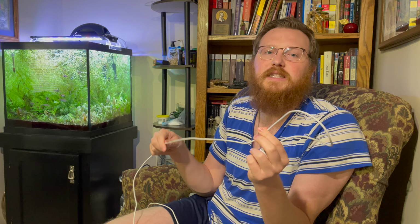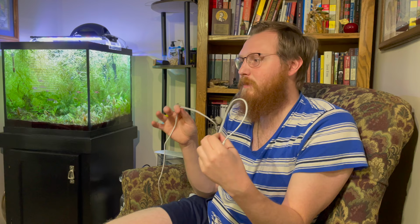I try to, but when you're moving things around and adjusting things, sometimes you don't realize that your cords are all just tangled up at the back of your cabinet and that there's no lines going down past where your outlets go in and going back up. And that's what happened to me when my hang-on back filter, which hang-on back filters are eventually going to fail at some point or the other, especially if you have a pump that's on the outside of your hang-on back filter, you're going to have water that will eventually start dripping from it somewhere, or seals that go bad. And that's what happened. I had an O-ring that went bad, and there was a slight drip of water that ended up going along this line, because there was no drip loop in it, directly down into the power outlet